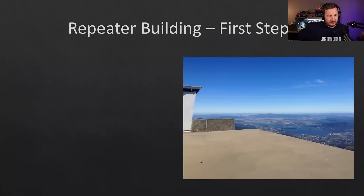When building a repeater, the first thing is to acquire a suitable site. The photo shows our main broadcast and transmitter site located above Hobart — it's the highest mountain and directly overlooks a majority of the population. In winter it can get below freezing, even in summer. All the television and radio broadcasters are also there, which poses a challenge because they run several hundred kilowatts of power, requiring extra filtering to remove all that RF noise.